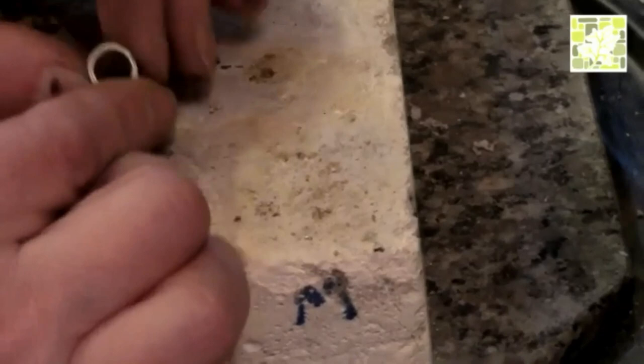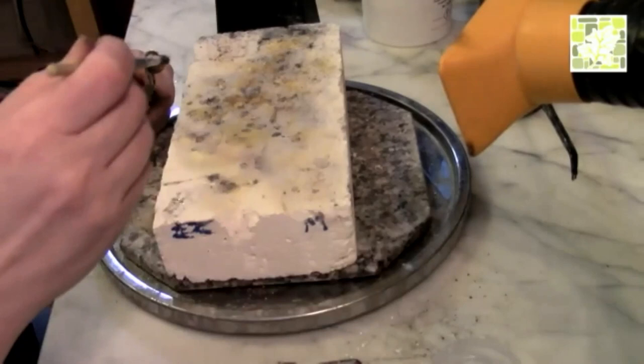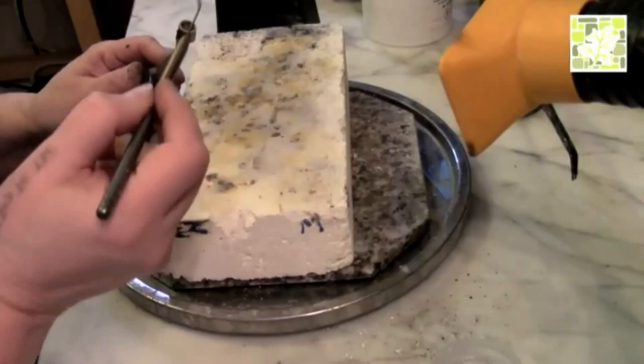And John's description is that we're going to hold this from the bottom, or from the top rather, so upside down. Let me zoom back out. We're holding it in our tweezers from the bottom, fluxing. And keep in mind that at this point, the angled bevel part is hidden right about there. So the mission of this soldering exercise is we're going to put solder on the top and get it to flow down to fill the gap we filed, to fill that little angle portion.